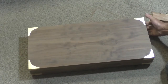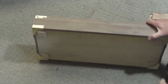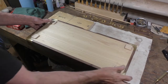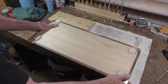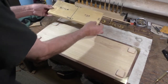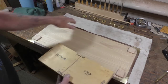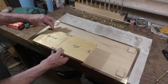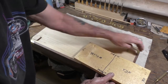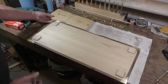The top turned out pretty nice and she'll be ready to finish when I use the true oil on it. Now everything's sanded, so I'm taking the corners off. I want the screws to go back exactly the hole they came out of because I've done some filing and sanding down of the heads too. So I made this board — this is the bottom placement, this is for the top, the back, and the front. I pull the screws out and put them in their labeled holes on the board, so I have all the screws organized where they go.